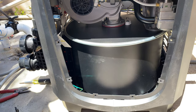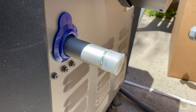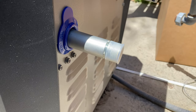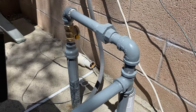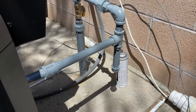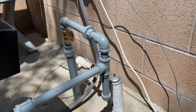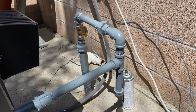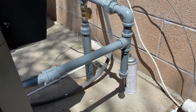The engineers were really on point with this. I don't understand — it even comes with the gas line already to the gas valve. This is ridiculous. So we just installed this gas line. Just make sure you do a sediment trap. I've never seen any sediment in these sediment traps, and to be honest they're questionable, but they're code and that's what the manufacturer wants as well. So you might as well do it, and do it right. And it came out clean — not too bad, I'll take it.